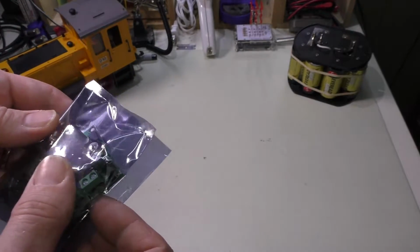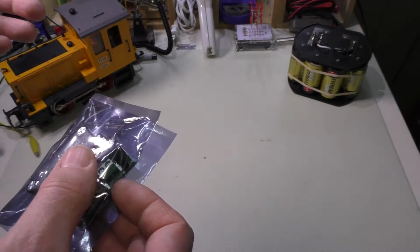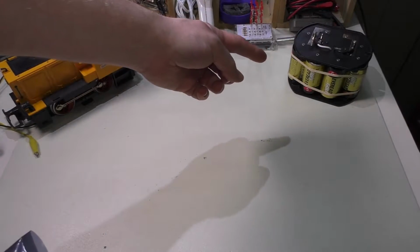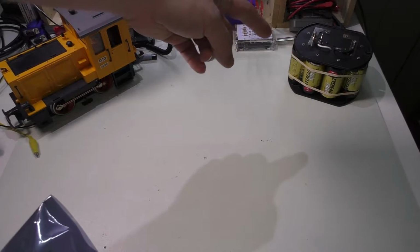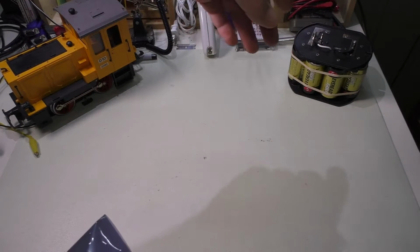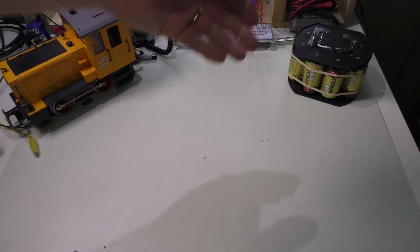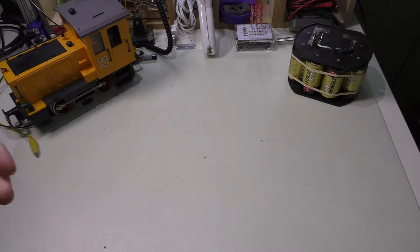And that's important for situations where you're using batteries, let's say, and the batteries go below a certain point and then no longer provide juice. And one of the instances I could think of is when you have a device like a battery pack like that, for example, and you want to get a fixed 5 volts out. Well, by default that's 12 volts, so you need something to step down to 5. But what happens when the voltage gets to the 5 volt point, because these are going to obviously get down to that point? Well, you have a circuit now that can actually boost the voltage back up to 5 volts. And I know there's all kinds of things about efficiency and whatnot, but that's kind of cool that you can actually do that and get a stable voltage.